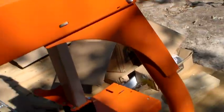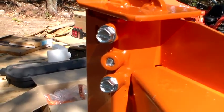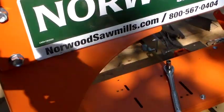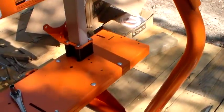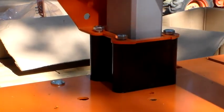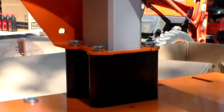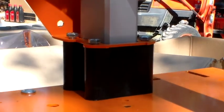We've got the bolts in the lower side frames and I was going around tightening, making sure I got everything tight — and twisted the head off of that one. I've stripped that one out in there. These are cheap. I know nuts and bolts cost good money, especially good quality ones, but these are cheap for the assembly of this thing. At the very least, they need to give you a torque value. Not happy. The next step will be to tighten the vertical guide blocks, which is the black plastic — there and there, on both sides. They recommend not to over-tighten these. With the luck I'm having, I'm going to take their advice.